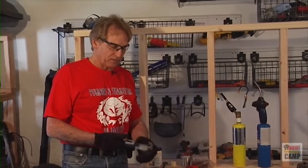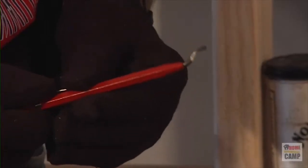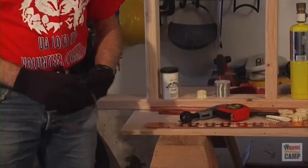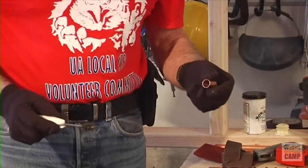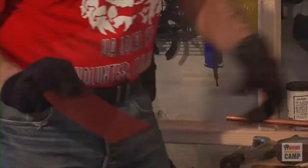Now that we've covered safety, make sure you have all the materials and tools you'll need. First, you'll need some type of tubing cutter — this is the standard one; it ratchets and you fine tune it at the end to cut. You need a pencil reamer for after you cut the pipe, to make sure the pipe is enlarged to the full bore. You need crocus cloth to clean the outside of the pipe, and a correct size fitting brush for the fittings you have. These are half inch — this is a half inch fitting brush that goes in tightly to clean the fitting. You can also use a brightening cloth; either one is fine.